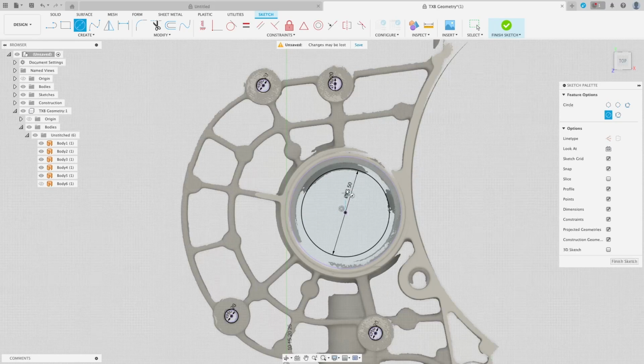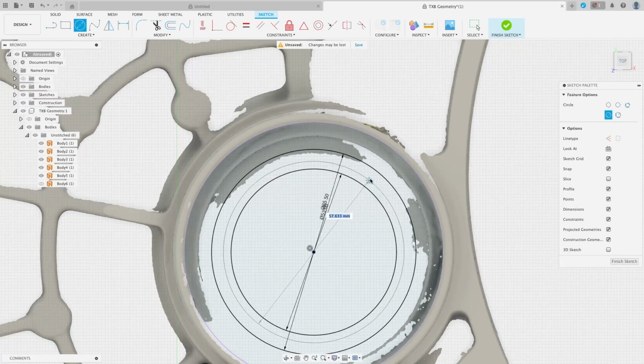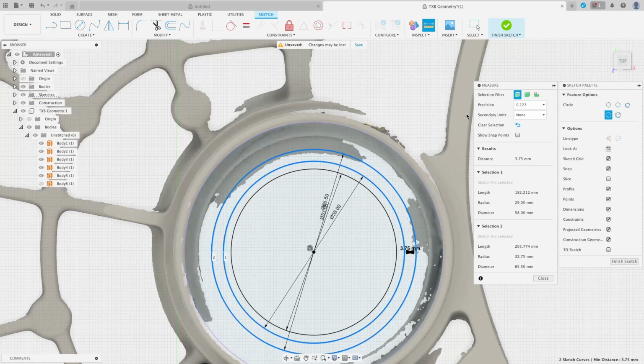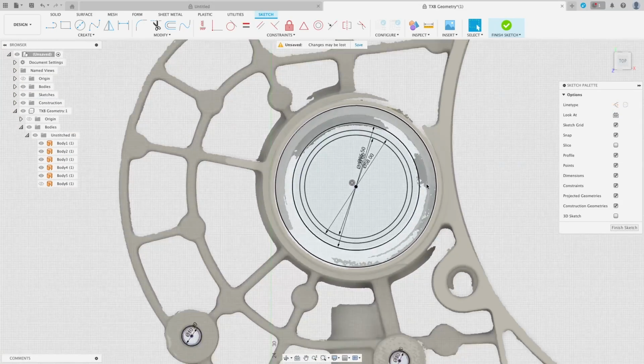And we've got that. Now we've measured, and the shaft that comes up from the diff is 53mm. So that's that there. Now we need to avoid that when we create the wall for this. So this protrusion, let's say, let's make it 58, and that gives us a little bit of space around it to allow for any misalignment. And we've still got a 3.75 wall thickness there, so it's not going to be a fragile sort of part poking out the back of it. And we'll say OK there.